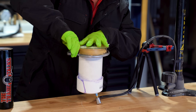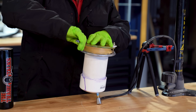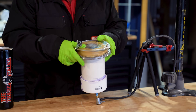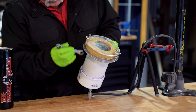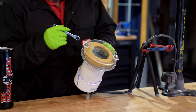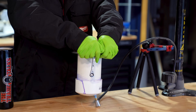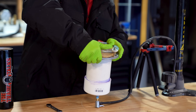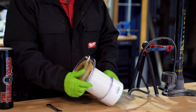By the feel of it, this is not as tight as I would tighten up a toilet, but remember the toilet's got that flange around it, so it's going to set on the tile on the floor and seal off. By looking at it, you can tell this wax is pushing out just about all the way around. It's pushing out around here and a lot around the back. I'm trying to squeeze it down just a little around here, about like it would be with the toilet. Let's pump this one up and see what it does.